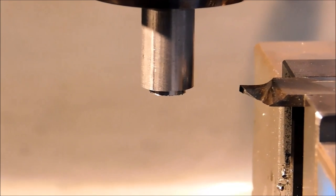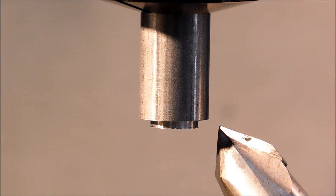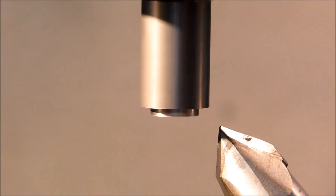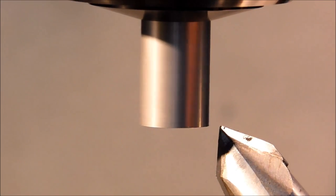While the part is still set up, remove the parting tool, put in a turning tool. Same philosophy here, guys. The spindle is turning clockwise, cutting tool is facing the rear. All I want to do is remove the part off remnant, and I would like to clean that surface up. So a good finish on this surface is relatively important, so take your time. No need to get carried away. Once it's clean, get out of the way.